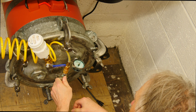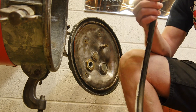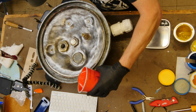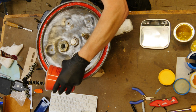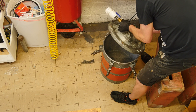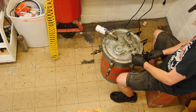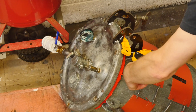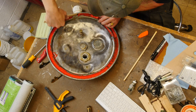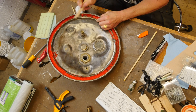Let's pop some pressure in and see what happens — and of course it leaks, right where the silicone overlaps. I pull out the seal but I can't remove the silicone from the existing seal, so I have to scrap the whole thing. I cast a new seal using some old Smooth-On 60D material with colorant added for an orange seal, and place it on top of the tank. Disaster strikes again — the material never set up, either because the Smooth-On was too old, or I put in too much colorant, or a combination of both. Super gooey.